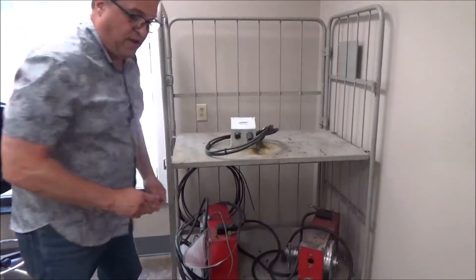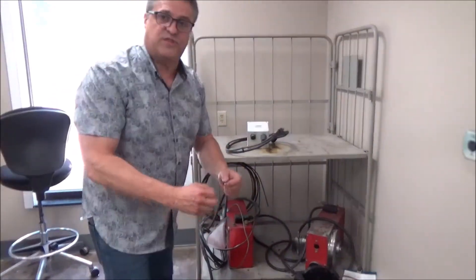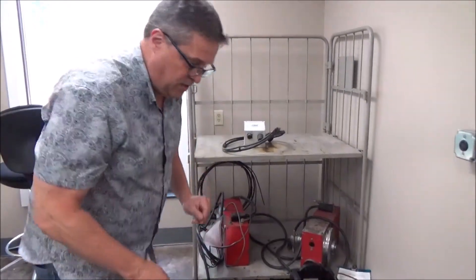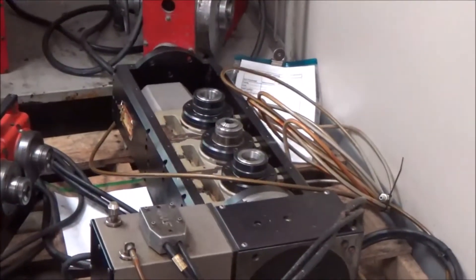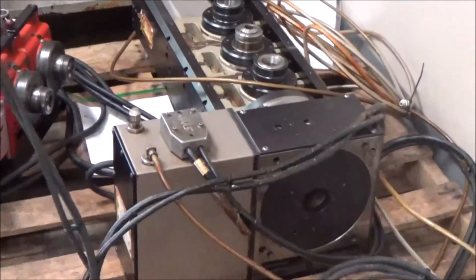To explain myself best: a brush drive uses the older DC drive motors that have little brushes in them. The newer AC brushless drive — which you'll find here — this is a tilting unit. So this is a two-axis, not three-axis, and it has three spindles in it for 5C. It still requires two motors: one motor to drive the rotary axis and one for the tilting axis.